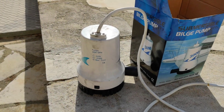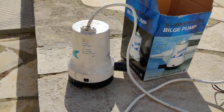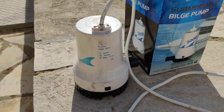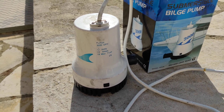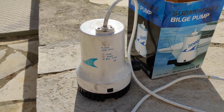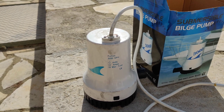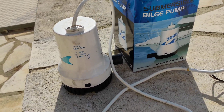These are the pumps used on the system. This was the one from last season — unfortunately they don't last too long. It's rated 3000 gallons an hour at the lowest head on the curve, at 12 volts. It says 13 amps running, but that's at the highest static head. Where it's currently located in the system, it runs at five and a half amps during the day, and that seems to be the peak.